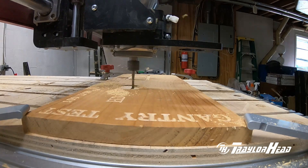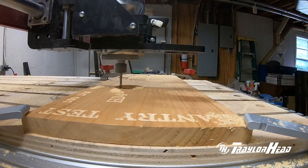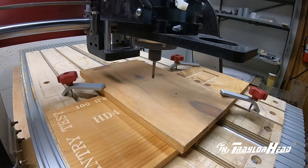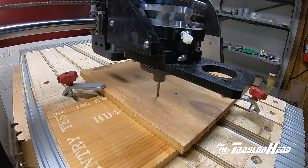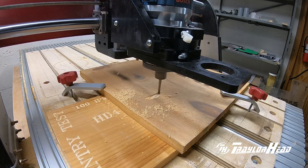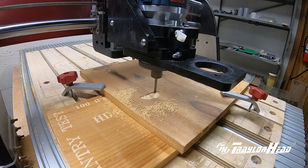When I do pocketing I cut with the grain of the wood, so it's a lot smoother and cleaner cut. I'll set a piece up and cut cross-grain. This is going to be the same cuts and same spots, but I moved them up in Z height and we're cutting across the grain instead of with the grain to see if we have any chattering from the bit — using the same downspiral cut bit and same speeds.